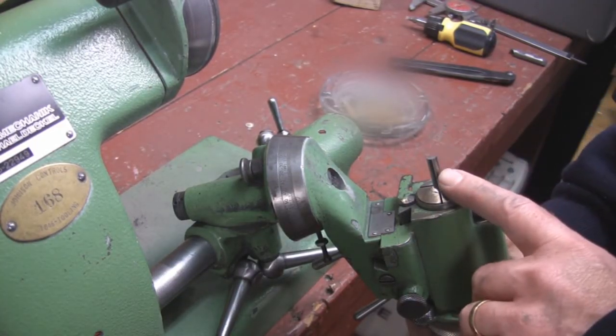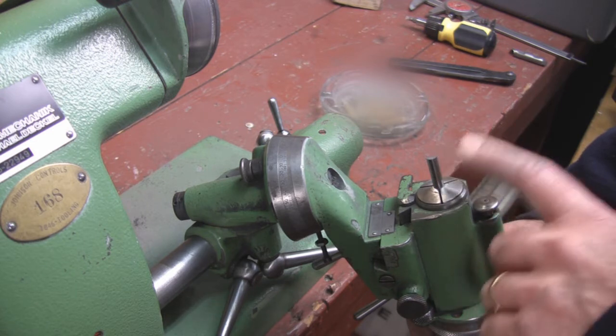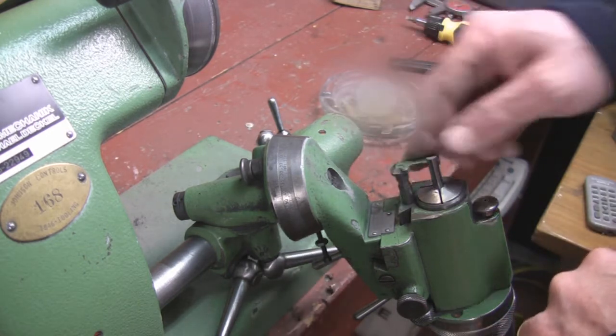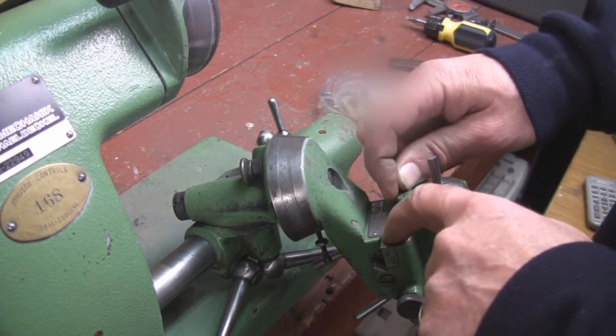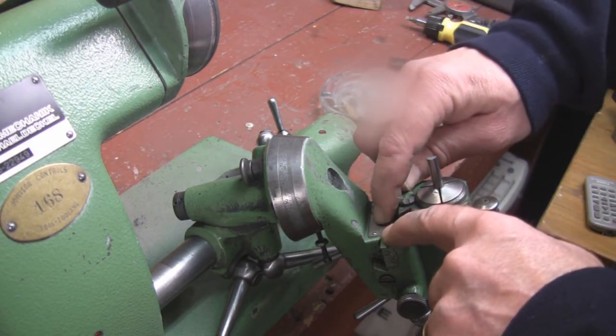So now we have properly installed a quarter inch diameter cutter blank into the collet. We've used the red dot to line us up. We've used this to make sure we're square, and then I've set the vernier, and you'll see this pop up as a slide here. I've set this vernier at a specific formula.